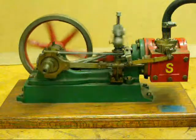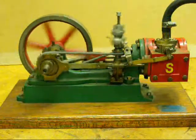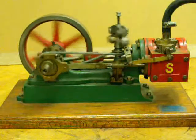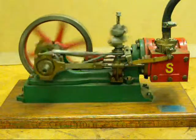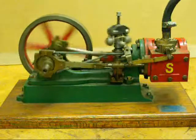This little engine has about a 5-inch flywheel, an inch-and-a-half bore, and an inch-and-a-half stroke. It runs pretty well. I think I'm running on about 8 pounds of air right now. I'm going to pinch off the line a little bit and slow her down.